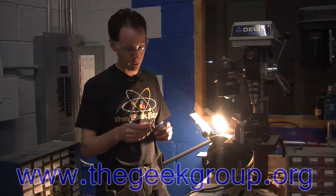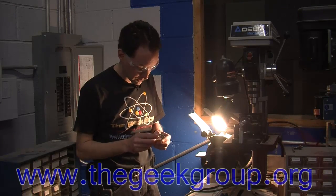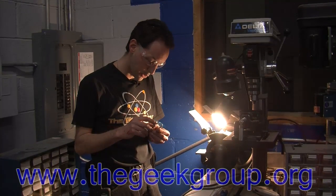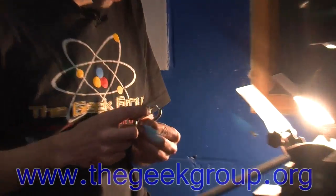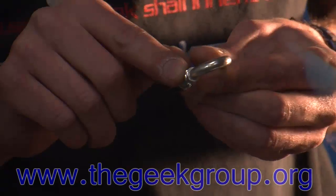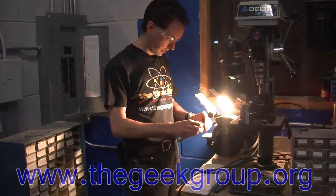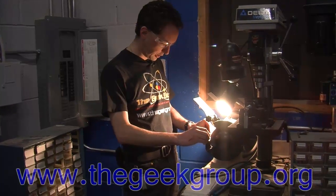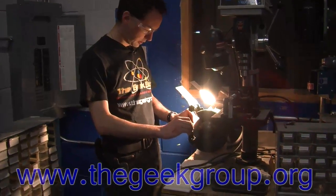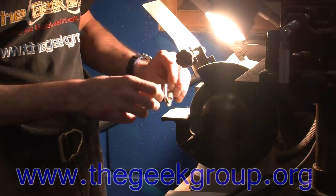All right, so back here in the corner we have our bench grinder, and here are the quick links that we're using. Now, at the top, there's the threading part here, and at the top of that, there's a shoulder that is just a hair too big to pass through the hooks at the top. So we're using a little bench grinder, and I just need to take a tiny bit of that off, just enough to pass through.